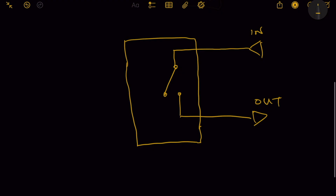So how do we get the switch inside the relay to open and close? We use magnetism. The switch mechanism itself is magnetic — it's metal — and if we create a magnetic field inside the relay, we can lift the switch and close it. We do that through the use of a coil.